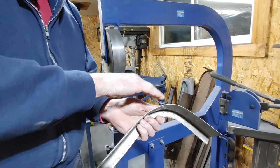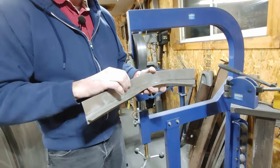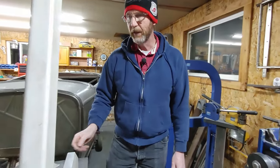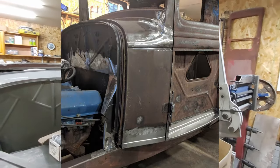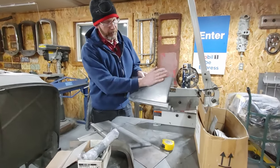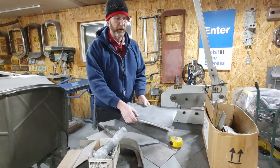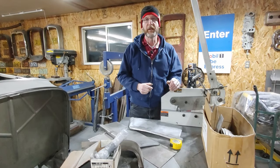Then for this edge here, I hammered it down and shrunk some of these along here so that it welded in place. They'll insert a picture of when I was working on it and how I welded it in. Some of the other things, like the bottoms of the quarter panels of the doors — same thing as what I did for the '32 five-window. Take a flat piece of metal, run it through the bead roller on both sides and then bend it over. That was the bottom of each one of the quarter panels and around the back of the cab the same way.